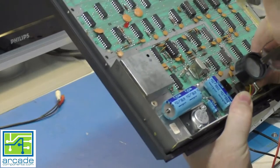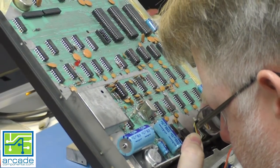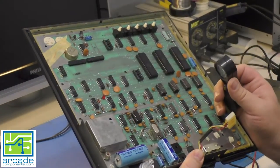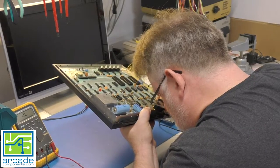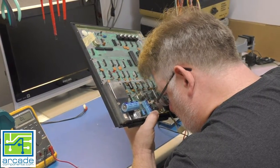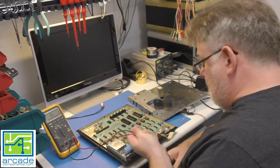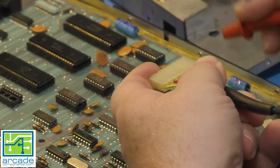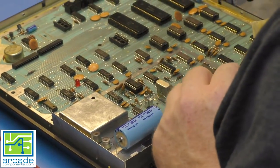The first thing I want to do is go down here and take a close look at everything with the jeweler's loupe, looking for cracked solder joints, anything that looks suspicious - busted components, cracks, discoloration, leaking, any obvious sign of something being wrong. I'm going to look at the solder traces where this connector is hooked up and check for solder shorts. Everything looks good, but I'm going to check it with the meter just to make sure there's continuity where there shouldn't be. There's not - all right, so we've got a simple circuit here.